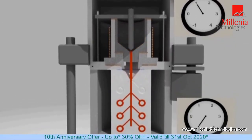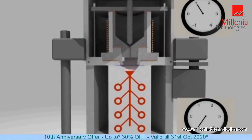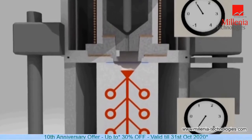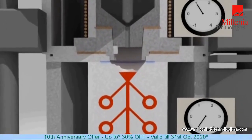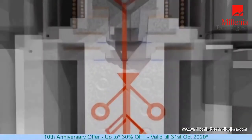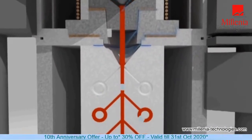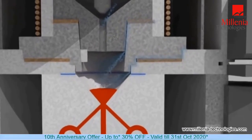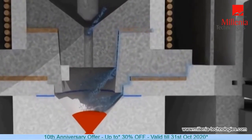When the crucible gasket and sealing are proper, the gas pressure will push out the metal from the crucible by increasing its pouring speed while the vacuum pulls it. But when the crucible gasket and sealing are worn, after a few castings, the gas pressure goes through the crucible ceramic holder and it's absorbed by the metal.